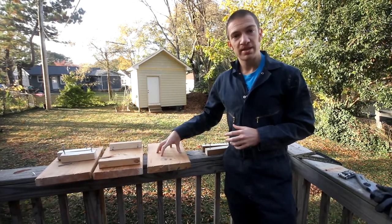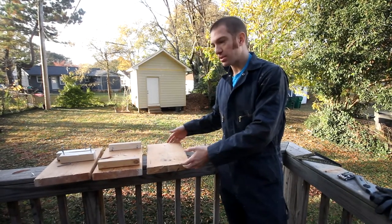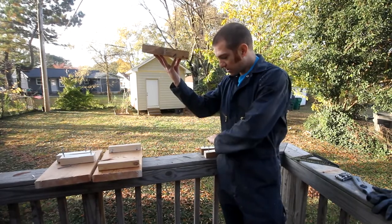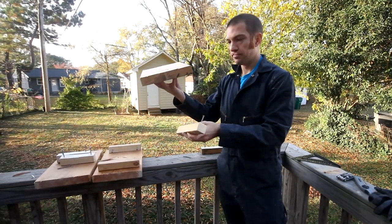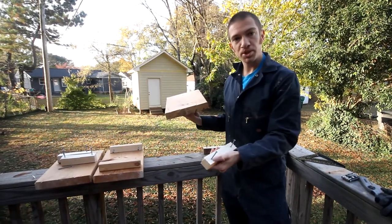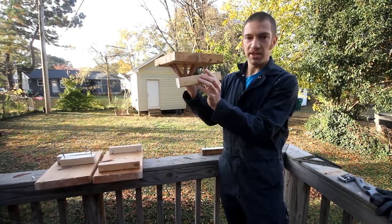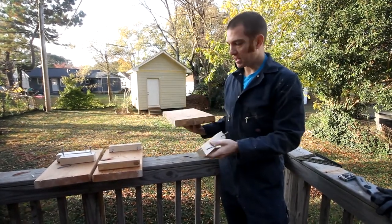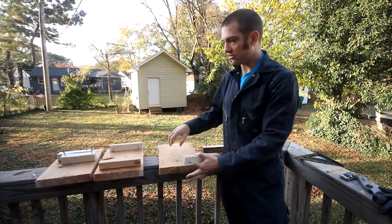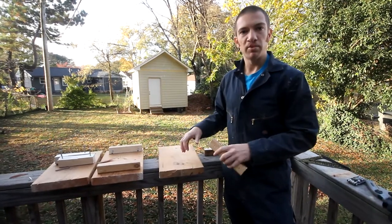Apply this solution in a low humidity environment and let it sit for at least 12 hours before proceeding. I went ahead and cut these 10-inch wide boards to just the width of the cavity, which is about 14 inches. The idea is that I'll prop those up there, and then I cut these little two-by-twos that are going to hold it in place. I pre-drilled them and put some two-and-a-half-inch exterior screws in. I'll press it up there and these will act as a ledge to hold the boards — I did a separate set for every board to make sure it's nice and tight.